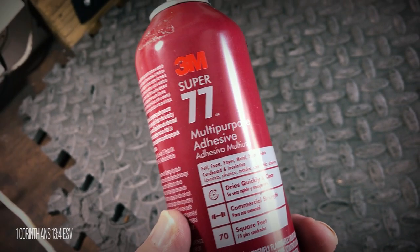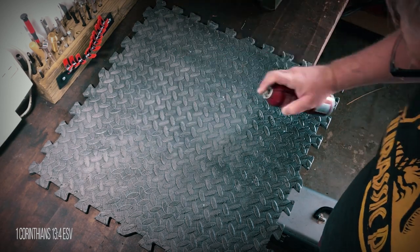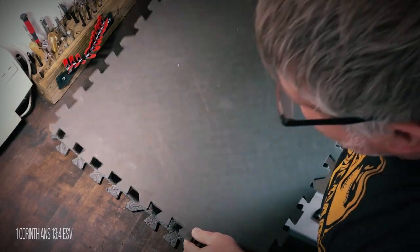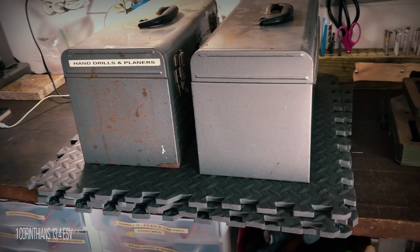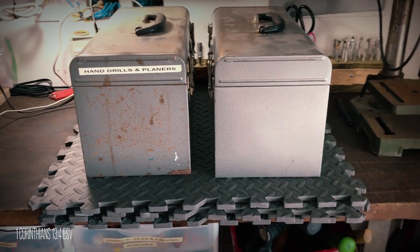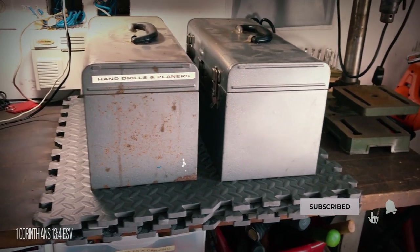I went over both pieces and removed the humps using the single blade planer first and then the other planer to finish the surface. Next, I used some spray adhesive to glue them together. I sprayed both panels and let them sit until tacky, used the back of my knuckle as the directions explained to check tackiness, then placed one on top of the other. I used the other two mats to protect the ones I was gluing and placed two heavy toolboxes on top of them to allow the adhesive to set.